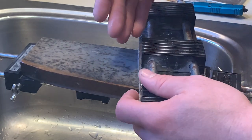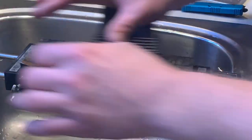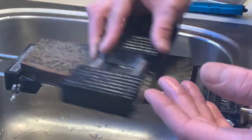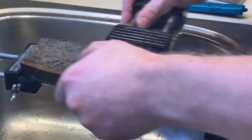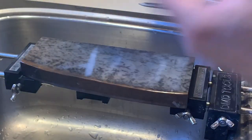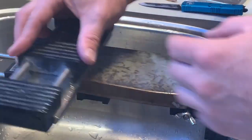If you take this stone and polish it up with lots of sharpening, eventually you'll feel like it's not doing much — that's when it's your ultra fine finishing option. For around a mirror edge finish or 30,000 grit ballpark, I find that mellow worn out diamond plates seem to give a really amazing surface preparation. The slurry will quickly transition you from a coarser edge to a fine one by eliminating rougher scratches.